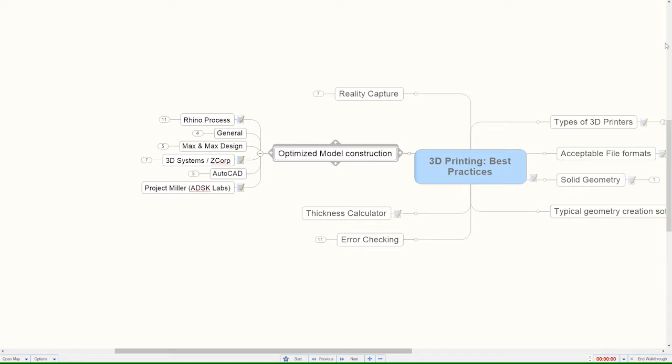I tell the story in my Revit class about masonry module. If you're building a building that is going to end up being a masonry building, then why not set your cursor, your snap setting, to 4 inches? Everything I model will be half block or full block.